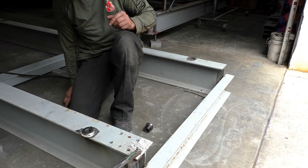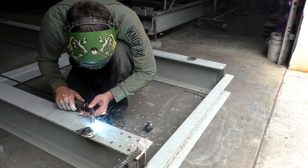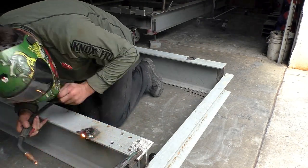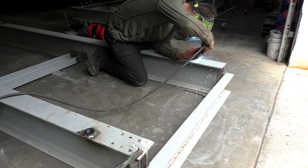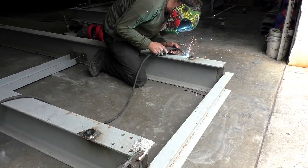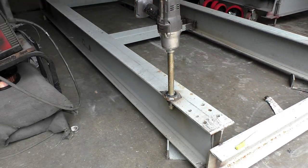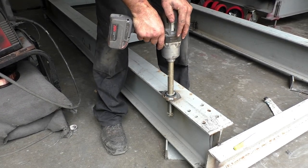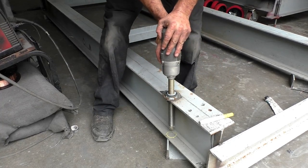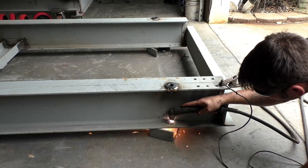I got the Zerk fitting pulled out of the weight jack. Notice what I did when installing this weight jack - I got the thick wider side on the outside and the whole frame jig is actually resting on that thick ledge. What that means is the weld is not holding any pressure - it's keeping the weight jack from spinning. The weight jack itself is set and holding the weight based on its wider area on the bottom, because remember the frame jig is upside down right now. If you install this the other way, you're basically putting your stress on the weld itself. Once the weight jack cools down, we're going to take the jack bolt and screw it down through the bottom to mark a hole on top of the frame jig, because the weight jack bolt is longer than the actual I-beam and needs to protrude through - that will also let us get our ratchet through the top hole and work the frame jig up and down.